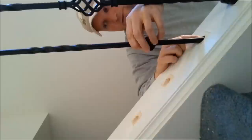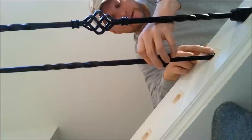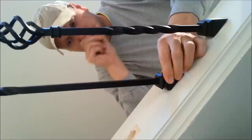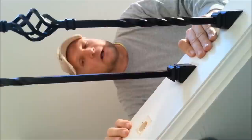You can use construction adhesive or glue. We're actually going to use a black silicone that sets up like an epoxy — it'll match the spindle up in here, so you won't see it and won't have to caulk around it. We'll fill that up and put the shoe back over with a little epoxy or glue. They have a set screw right here that we'll lock in. Keep in mind, all this is for decoration — aesthetics. It covers up the hole you made. We'll sand down where the old spindle was, prep these, and put paint back on before we silicone them all in.